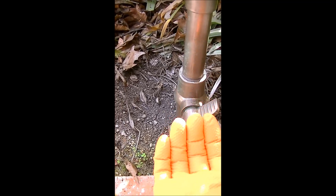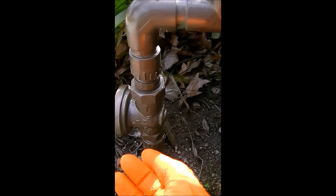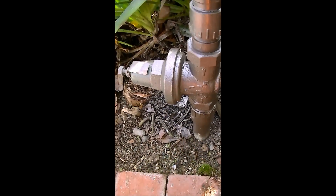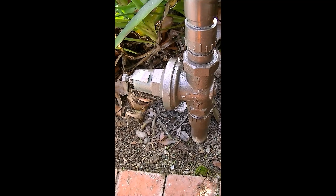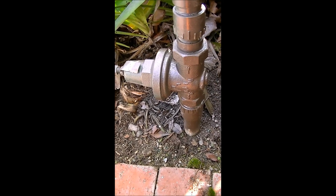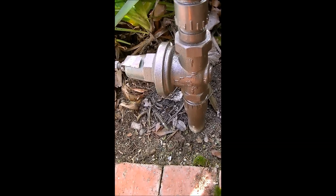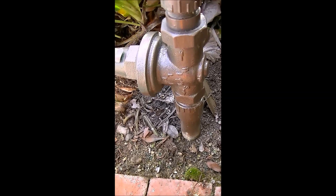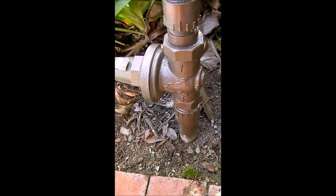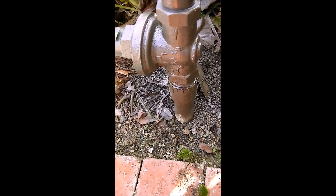There's an elbow coming up, a valve here, then an elbow, a T, and just a section of pipe with a cap on it. Then coming down here, the water pressure regulator — to me that is critical. These are expensive now; they're not cheap by any means, so be prepared for that. Make sure that all of your joints are real tight, because once you get this together, you don't want to take it apart. I use pipe joint compound and all that.